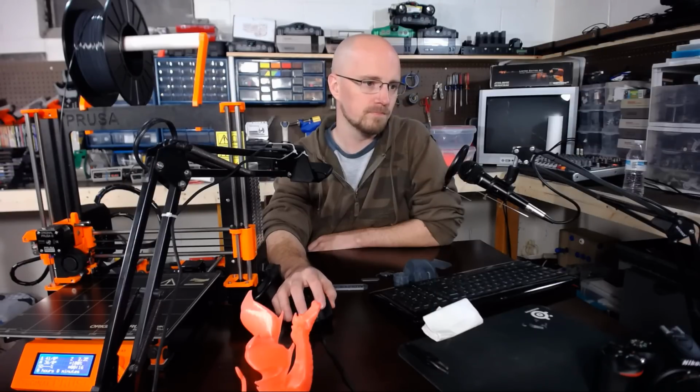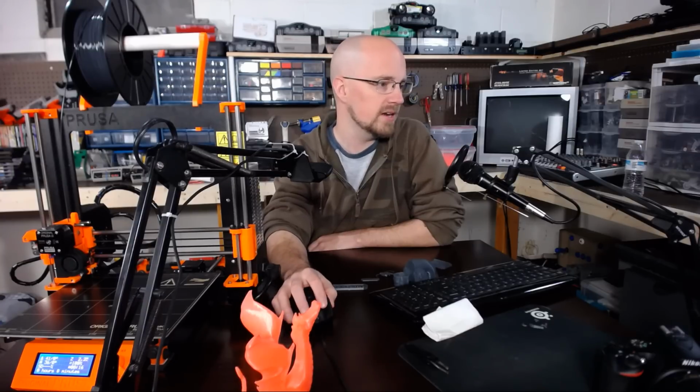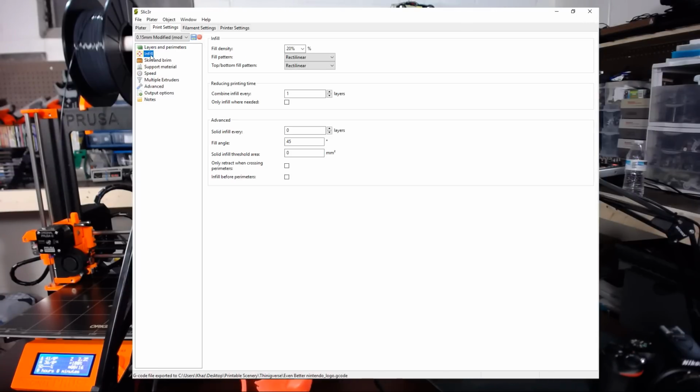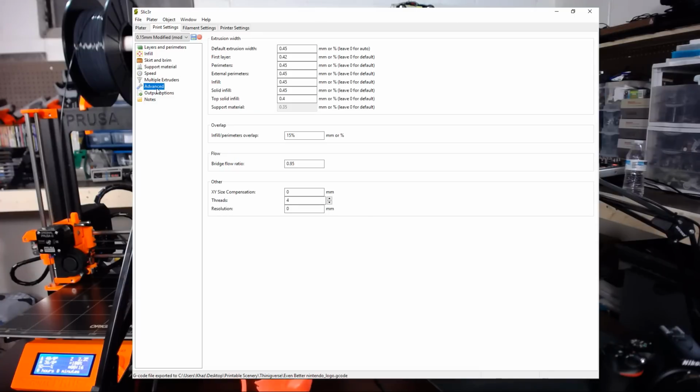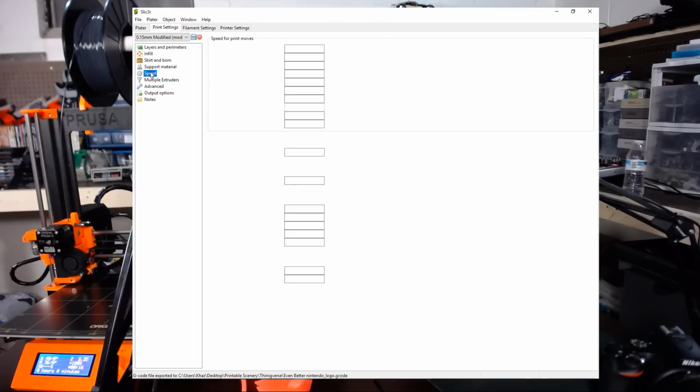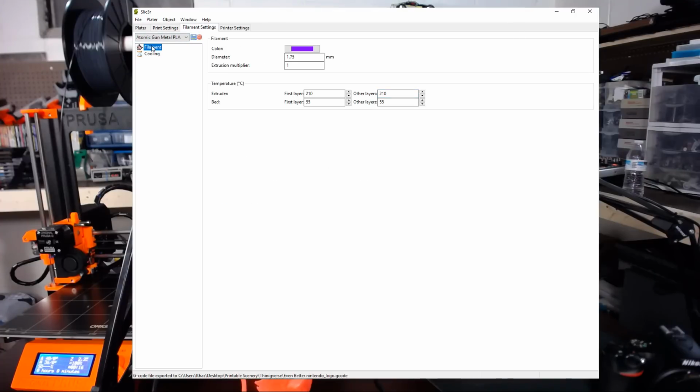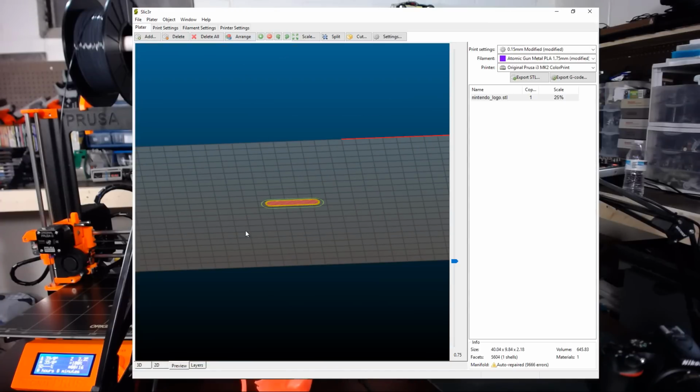But I'll go ahead and change that setting in here now. I guess I can put it up just so everybody sees what we're talking about. It was the... where is that? Is that in the filament? Extrusion multiplier right there. We'll try that. And we'll just set it to 0.99 like you said, and see if that makes a difference. It's funny that's such a subtle change, but we'll do that and then scale this up to something bigger.